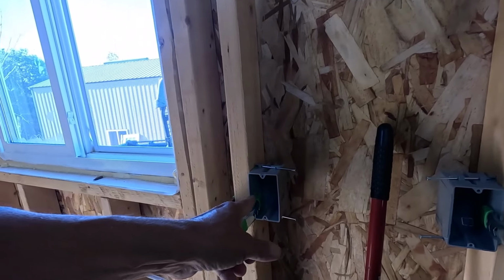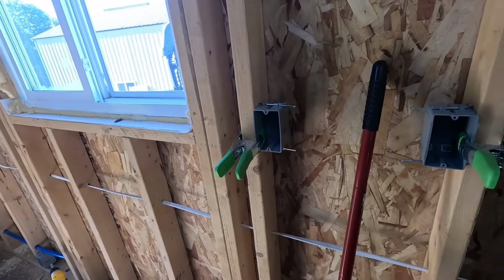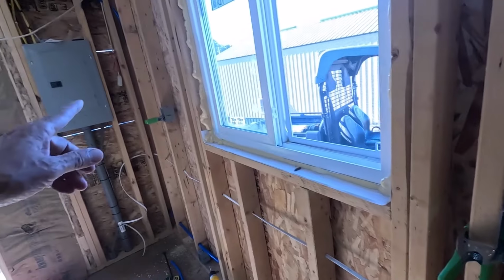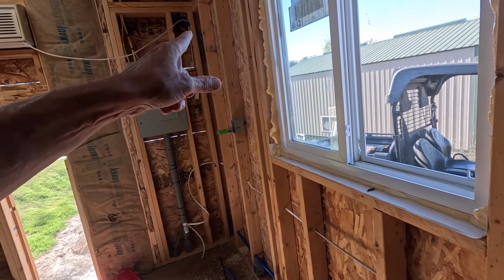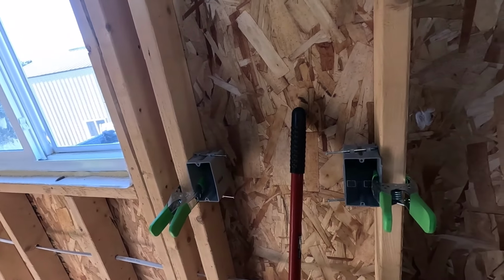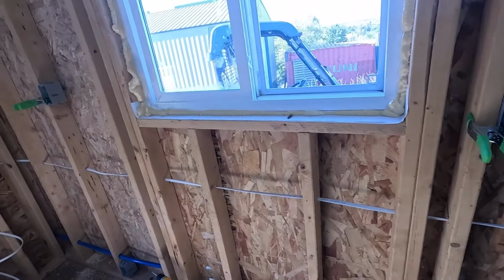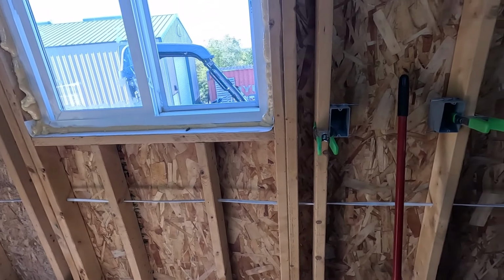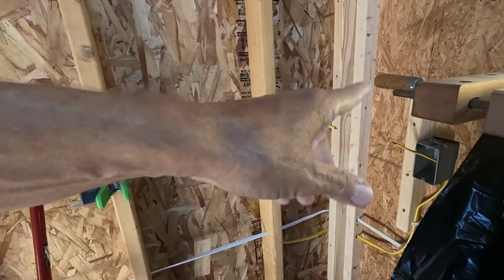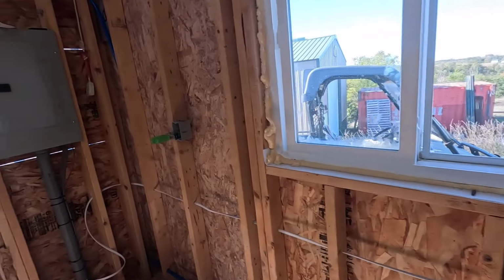Well, actually, I can put a 15 amp outlet on this and one of those sideways switches, but then I would need a GFCI. I probably need, yeah, I need a GFCI for that one as well. And well, I need it for all of these, except, I don't know. I'll have to go look at the Uniform Dwelling Code and see what they say. I believe I'm going to need GFCI for all of these, except for possibly that one there, but that's not a big deal.